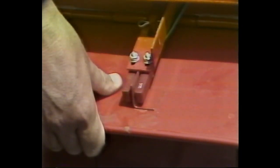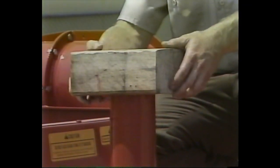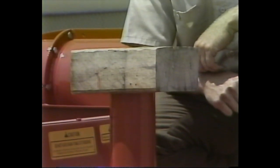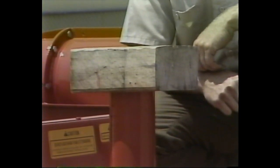Next, lift the walker overload plate and note if the light and tone activate. Engage the unloading auger. Both the monitor light and tone should activate. With the engine running, completely cover the air cleaner intake pipe with a block of wood. This should provide sufficient restriction to cause the light and tone on the monitor to activate. And finally, run the tachometer back and forth through all four readouts to see that it is working and that the readings are reliable.